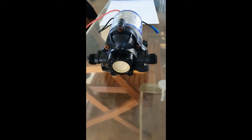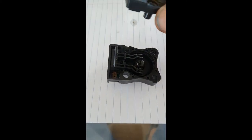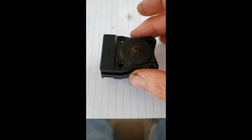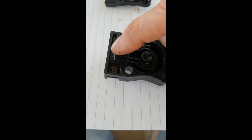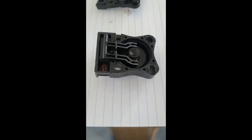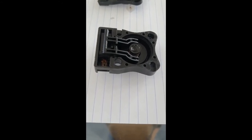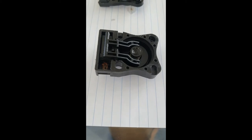Here's the pump with the pressure switch taken off. I've taken the pressure switch apart so this housing just sits on top like that. This screw adjusts the pressure at which the cutoff actuates. There's a micro switch under this little rocker and it looks like the micro switch has failed, so I'm going to take that apart. From the research I've done, it looks like it's an Omron part — fairly easily available and reasonably cost effective to repair.